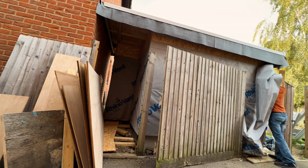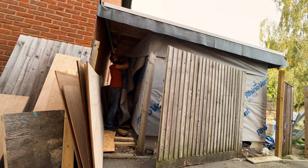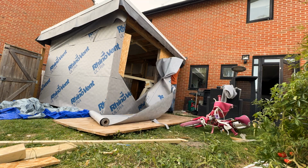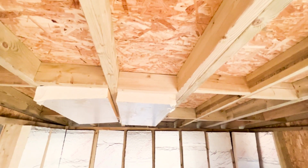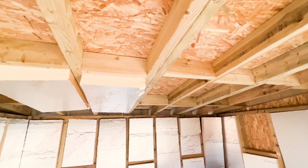And when I researched this further, it's perfectly okay to put roofing membrane on the walls, but you cannot put wall membrane on the roof because the roofing membrane is higher quality. So it worked out better in the end, and I do like free things.